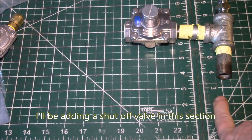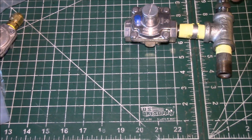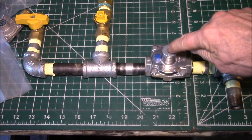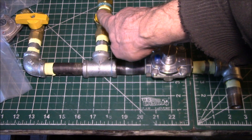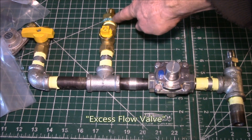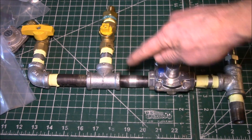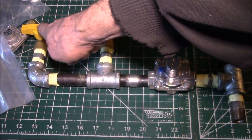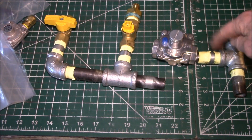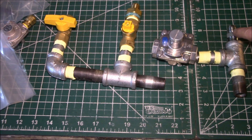I've got a flare fitting up here where I'll be able to hook up a propane bottle — I would shut off the natural gas valve and hook up a propane bottle with a high-pressure regulator. This will be capped off most of the time. That feeds into the regulator, and out of here I've got a T with a shutoff valve and flare fitting for my stove. This has a safety shutoff so if the stove springs a leak it will shut off the gas above a certain amount of leakage. Off the T goes another shutoff valve where the grill connects.